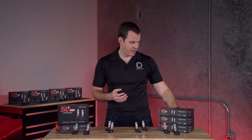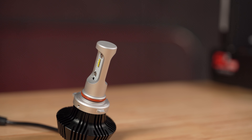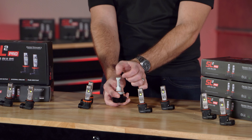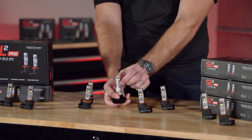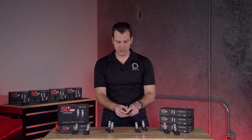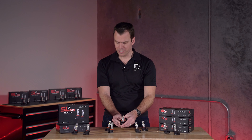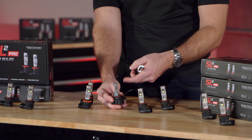To help with that, some manufacturers actually designed pretty wide areas between each side so they can put a larger circuit board. The wider the circuit board is, the easier it is to get that heat from the LEDs. But again, that causes problems because it's not just about how small the surface area is — we also want to get these quite close together. There is a limit: we don't want zero width because there is that filament width to match. As technology progressed, more manufacturers went to bulbs where we actually just have a single circuit board with the LEDs mounted to either side. You can see how much thinner that one is compared to this, meaning this should provide better output. We also did this with our SL1, with only a one millimeter circuit board — really thin — so that we had the best performance possible with the technology at the time.